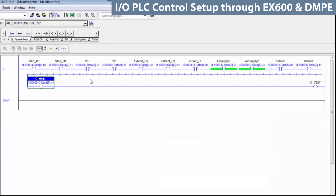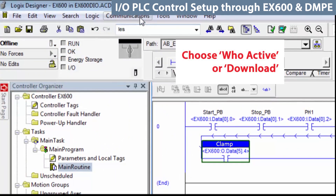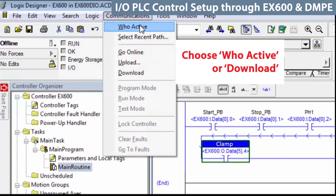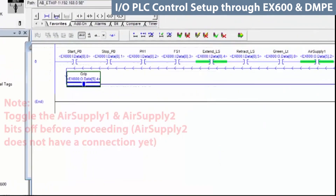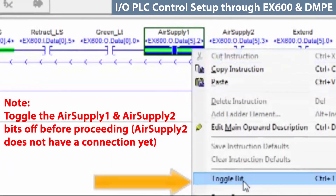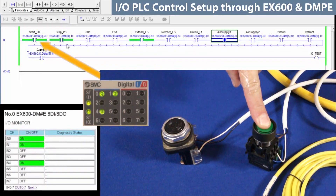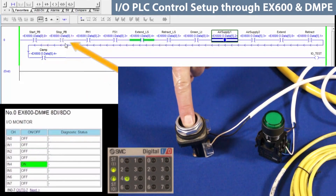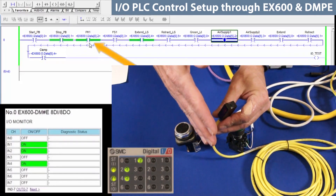Now, as the rung items are blue, we see that the inputs and outputs have been accepted for the program. Make sure to check out the items on the rung that are showing as on and running, then save the program. Next, run WHO active from the communications tab. Now download the application into the PLC. Next, press the start button — we see the input signal here on the rung. Now press the stop button. If you put your hand in front of the photo-eye beam, we see that motion here too.